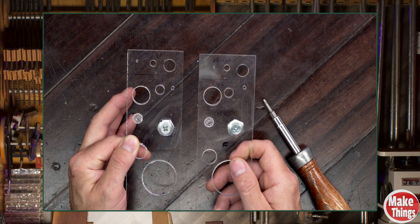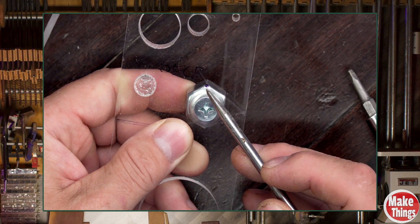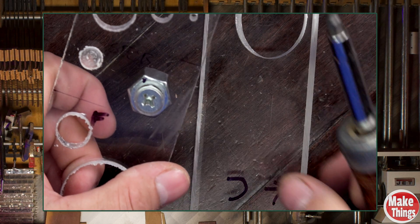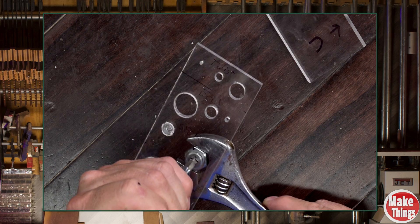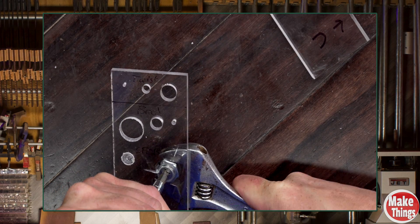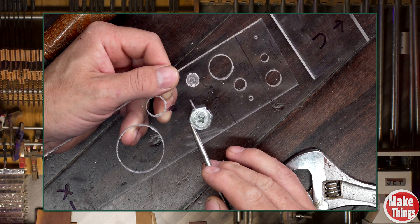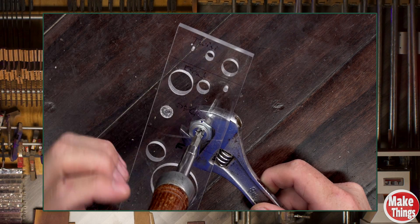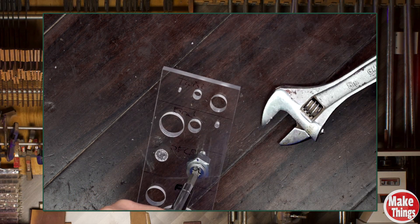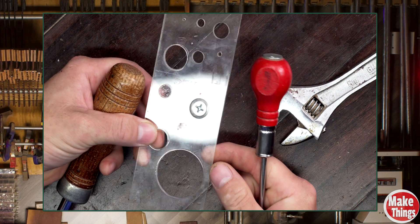But jigs don't need to look pretty — they need to hold up under pressure. They need to take a bolt without splitting. I've marked one of the hex head points on each sample and I want to see how far I can go before it actually breaks. On the extruded, I'll line up on that mark and twist. And you can see there's a crack — it took me from this point all the way over here.